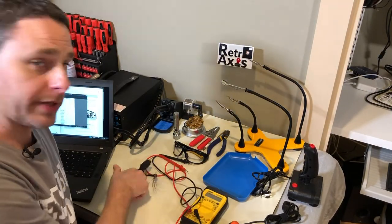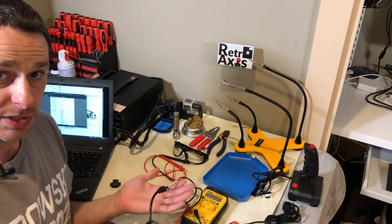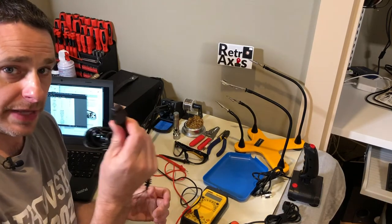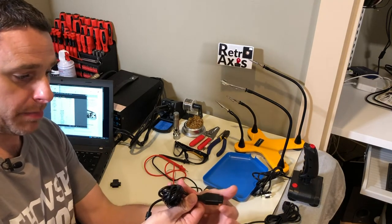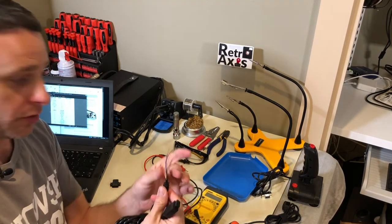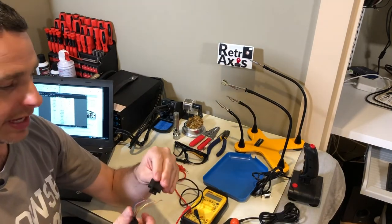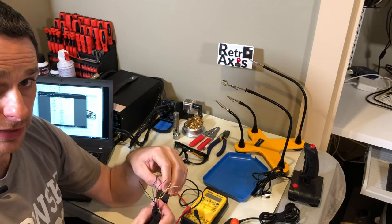Having completed the tone-out of the pins and colors, I'm now ready to put this thing together. The way this is going to work is that this plug goes into the Sinclair Spectrum, taking the pinouts as assigned on the Spectrum side. We'll then cross over to this connector, which will be Atari-pinned, so that as I plug in Atari-based joysticks, it should just pass the correct signals through. Let's give that a shot and give it a test.